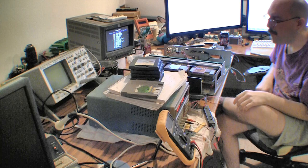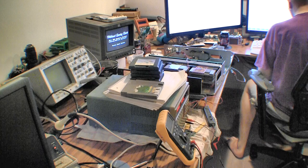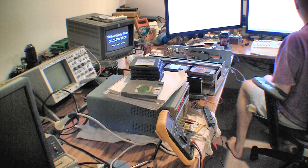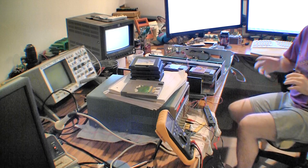Ooh, so this seems to work. So now I'll do the hold-the-button-to-reset trick, and I'll get rid of that on the attract mode. I will cut out my beautiful code that I did. Here, all I have to do is just that and that, and I think that'll work. So there's 0. Oh, it's still got that 1. Oh yeah, now it's going to play each game twice, because it's using the lower bit, which toggles each time, to show the attract mode or not show it.